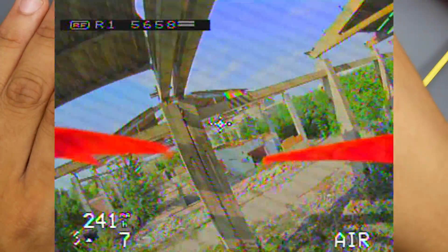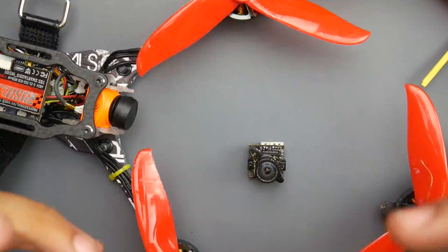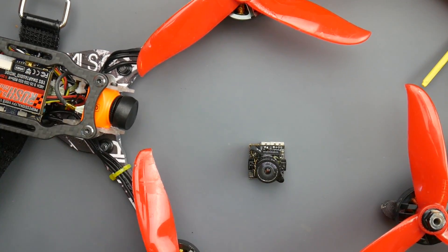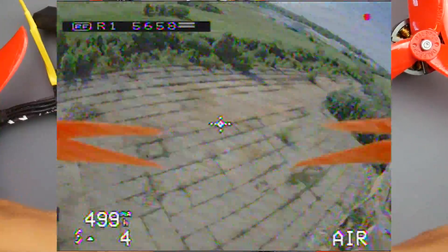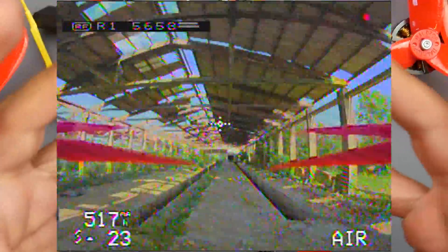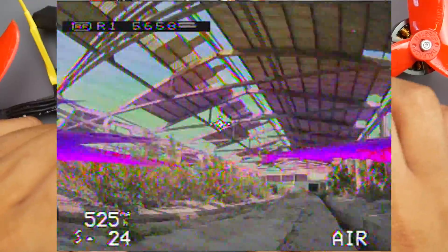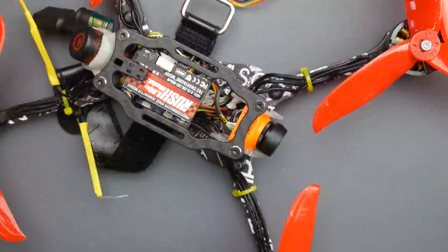The wires are pretty thick, just hanging down, and depending on the wind they change their locations. I really try to avoid them so I don't ruin my quadcopters. There is some sort of noise — it's not that bad, but it's more apparent in the DVR. There are these diagonal lines that come across. I know it's not from the quad because I've tried other cameras with it. I think it could be from the voltage regulators on the main board, or this is picking up some sort of RF signal and acting as an antenna, routing those lines in.